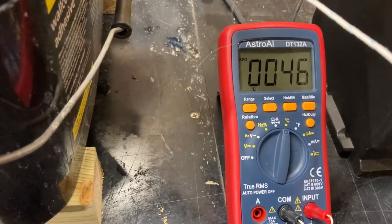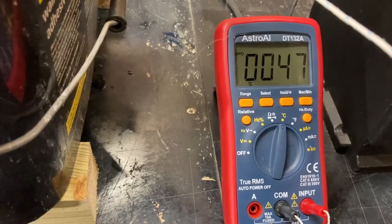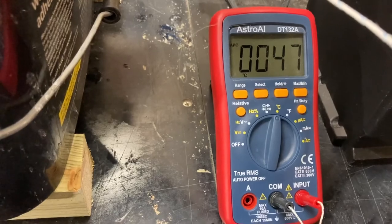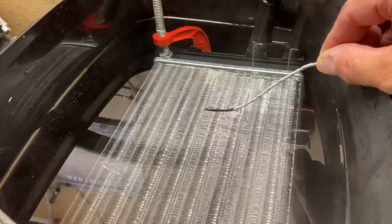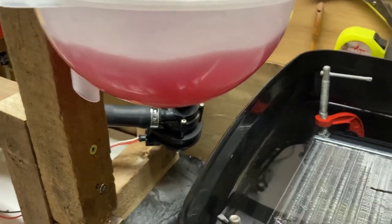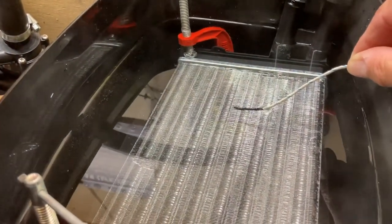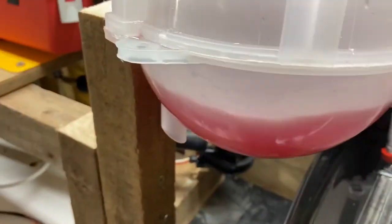Admittedly, it's a small tank. It would take a lot longer for a bigger tank. That's something I need to think about, the size of the tank really. 25 litres is my preferred size. All the steam coming off now, can't you? Like I say, the expansion tank is only about 5 degrees hotter than above this heat exchanger, so it is very efficient in exchanging the heat from there.